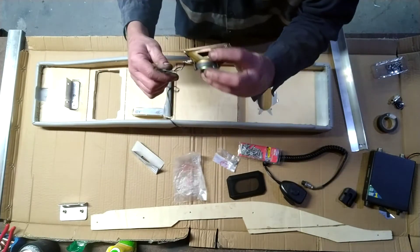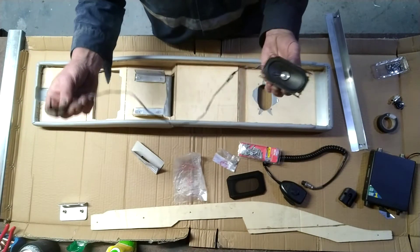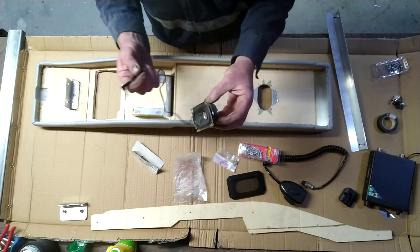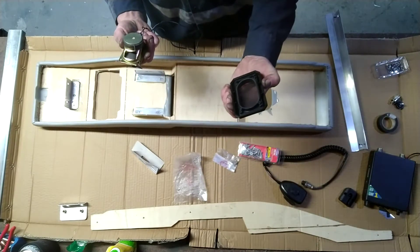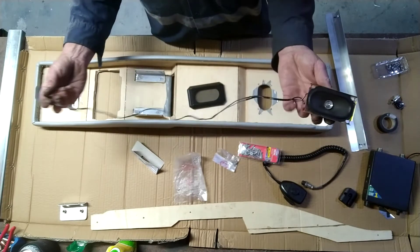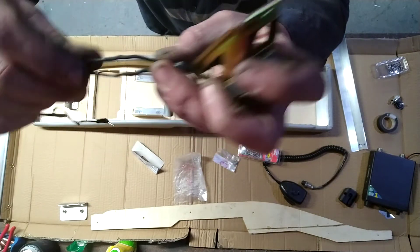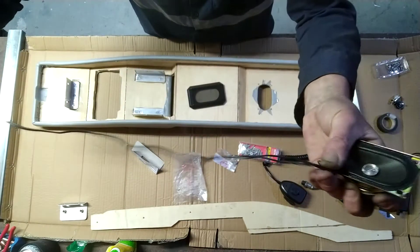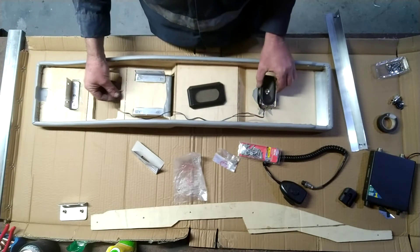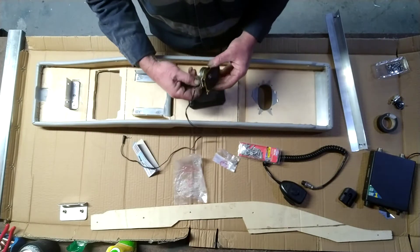This is the speaker — one of those portable extender speakers you can buy from Jaycar. I think they're made by Benelik. I pulled this one apart completely; the lead was extremely long so being an electrician I've just cut, soldered, and heat-shrunk to shorten the length of it. It's only going to go from there to the back of the radio anyway.